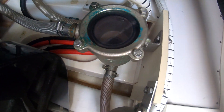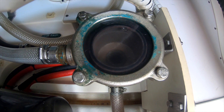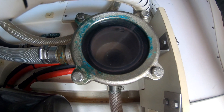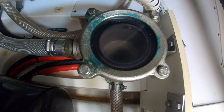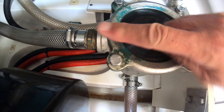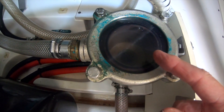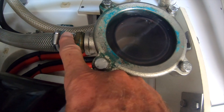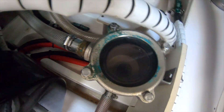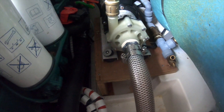The first thing is to find out if the strainer is blocked or dirty. If that isn't the case, I'm going to stick a hose pipe in through this hose here, take it off, put the hose pipe through to this pipe, switch the hose pipe on, and it will go straight through the pump and hopefully bleed out any air in the system.